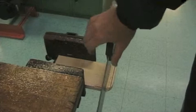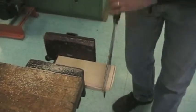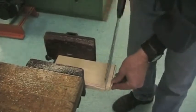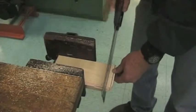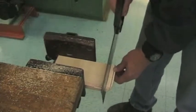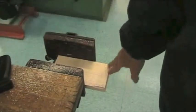Try to keep the cut right down the line. As you come closer to the edge or the end, lighten up on your pressure, because if you push real hard it's going to crack the wood. We've finished our cut right there.